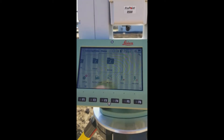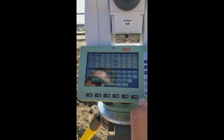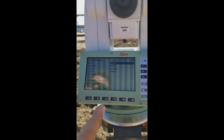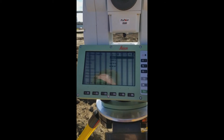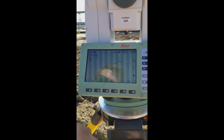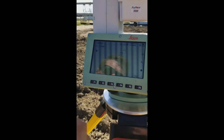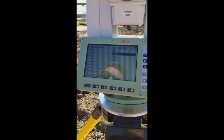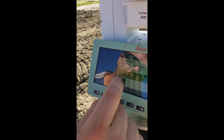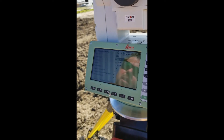I've leveled up my instrument like last time, except this time instead of auto setup, I'm going to hit setup and do a resection. I'll give it a point ID for this particular spot, say okay. But this time instead of an auto deal, I'm going to say measure target one and aim manually at my known checkerboard targets. Using the 3D viewer I can look around — I know the point I'm looking for because it's written on the wall, so I'll say 1006. I'm set to reflectorless; you can change that by going here and hitting measure any surface instead of measure prism. Target height zero because I shot it with a zero height.